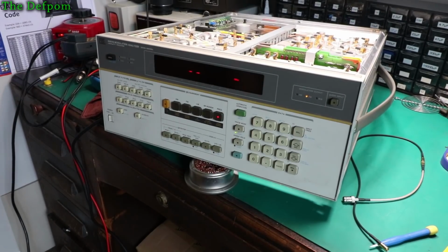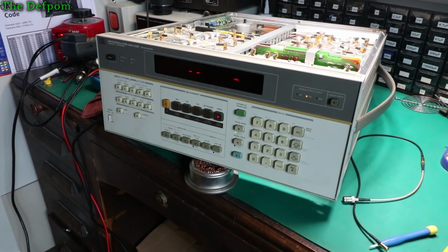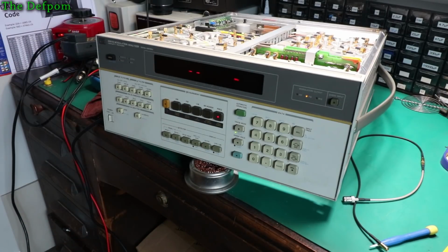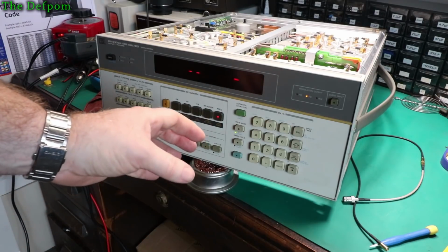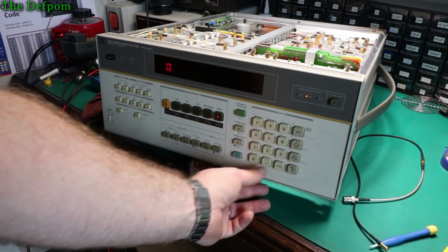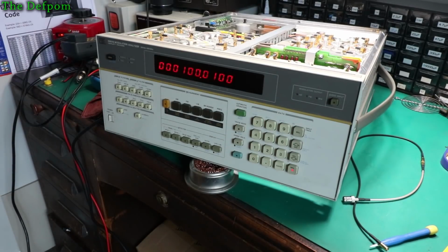Right, so next part in this little calibration is to set up the RF level detector. So we'll try doing that. Now, it's a special command apparently. It's in the manual. Adjustment 3 it's called in there, which is page 398 of 433. Anyway, it's supposed to key in 0.024 special, which switches out the 5.25 MHz high pass filter and sets the RF level detector to normal output.